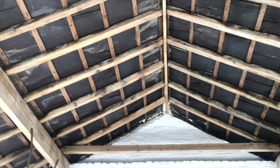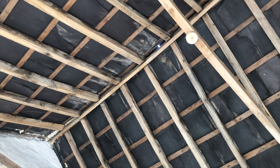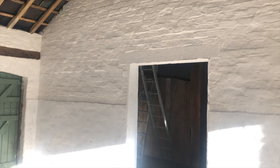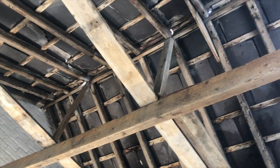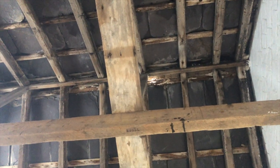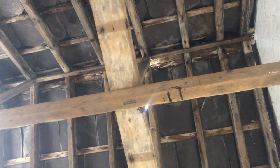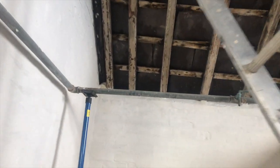I'm going to try expanding foam for the leaks, which is awful to use because you're spraying it against gravity and it drips and falls out of the holes. This roof isn't too bad — there are a few holes and some light coming in through the slates. But through the archway into the other room, the roof looks a lot worse. Someone has previously tried to mend it and it's all a bit of a mess up there. There are more holes, including one really obvious one, so I'm going to have to get up there and fill those. But basically, between all the rafters I want to put foam insulation.